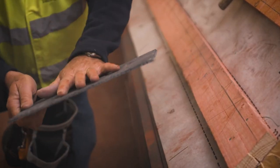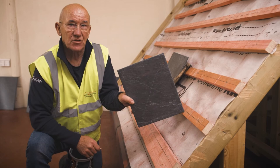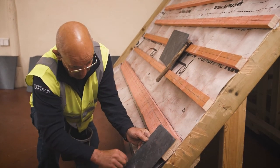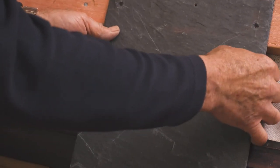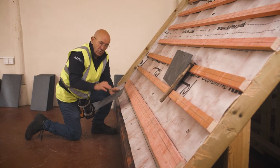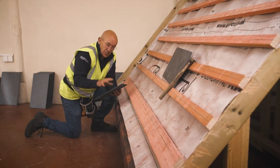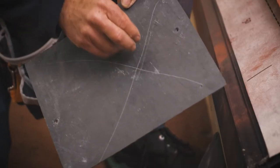What I've done now is measured my eave, marked my eave, cut it, and holed it. That's my pattern now. So I would mark it to show that it's the pattern and I don't want to use it. What I want to do now is check it — check that it fits in place. That edge should be there, so I want to check that across here. That's in the right place. You would check this all the way around your roof. Once you know that the eave fits all the way around your roof, you count up how many eaves you need. You use this as a pattern to mark, cut and hole as many as you need — if you want 40, you mark 40, cut 40, hole 40, and you have 40 to use.